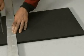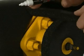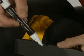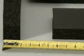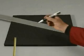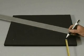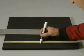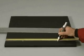Measure the distance between the furthest points of the cap and packing. Bear in mind the thickness used and measure the difference in distance from the cap. Mark this distance on the piece of sheet. Divide this length into 4 parts. Use this distance as radius to draw, with a felt pen, the circles and semicircles necessary to join the resulting profile.